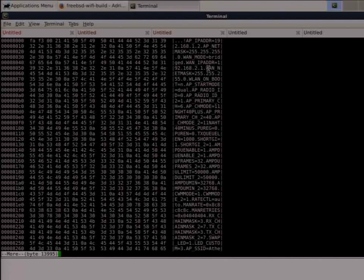Yeah, it teaches the driver, if you request this power setting, this is your fudge factor when you actually program the transmitter or whatever. Oh, so it's the default. There you go. So that stuff there, the vendor burns that in, and then the vendor version of OpenWRT, DD-WRT, or whatever, may or may not read that for whatever reason. So it can or can't use that. That's arbitrary to whatever they're doing. Like our FreeBSD Wi-Fi stuff doesn't actually look at that.